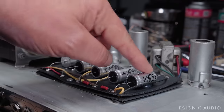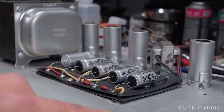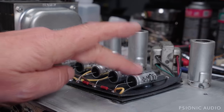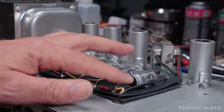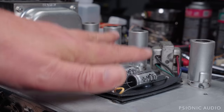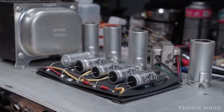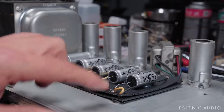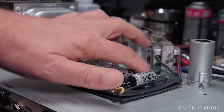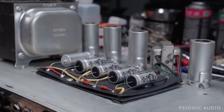There's a little dab of silicone underneath each cap for this reason: on the old one there was a strip of foam inside the doghouse cover which pressed down on the caps, but that foam no longer contacts these smaller capacitors. We want the capacitors held in place so the strain is not on their leads, because cap leads can break off right where they join the body if stressed. So I put a little silicone which holds it in place from the bottom, and when it's time to change them out, that silicone peels right off the fiberboard — it barely leaves any residue.